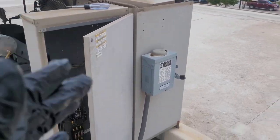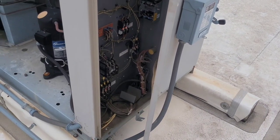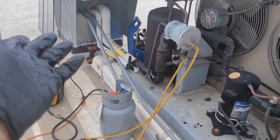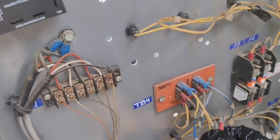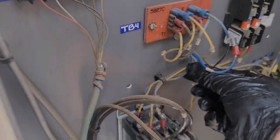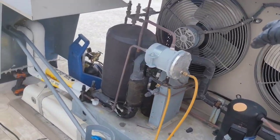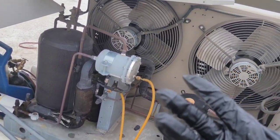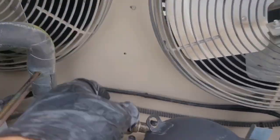On most systems when you power off the disconnect you're going to kill power to the evaporator and the liquid line solenoid valve so that valve closes. While this step isn't strictly necessary, I like to unhook my contactor - make sure your power is off before poking around in here. Disconnect my contactor and turn it back on - this keeps my compressor and condenser fans off and opens my liquid line solenoid valve. I've looked at this more closely and I won't have to recover the whole system - I can isolate the condenser with this valve on my discharge line.